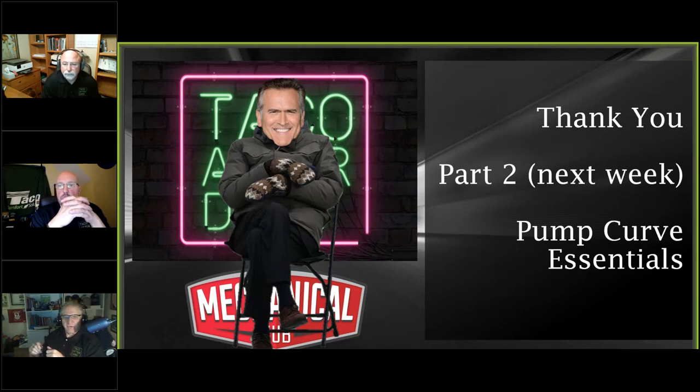Bob asked one good question about the takeaway sheet. What is DTD? DTD stands for design temperature difference. When you're doing a heat loss, you have to know what your design temperature difference is. It's a multiplier that we use. The design temperature difference is the difference between your desired indoor temperature, let's use 70 degrees as a number, 70 degrees indoors minus your outdoor design temperature, your quote unquote coldest day of the year as recommended by ASHRAE.